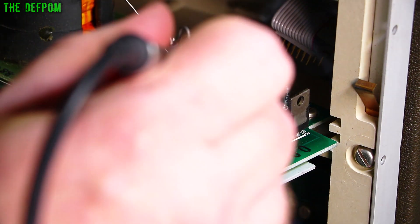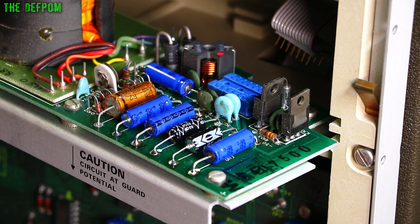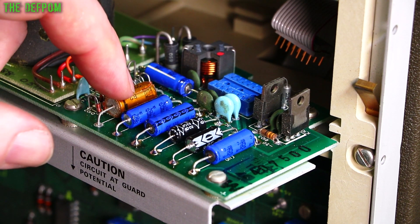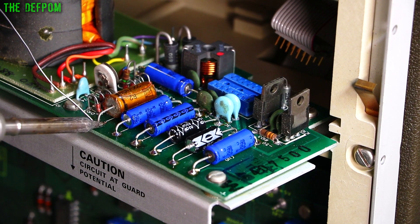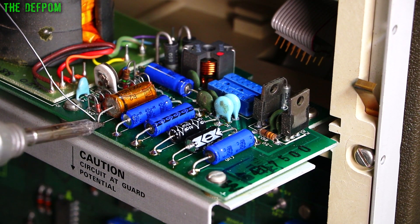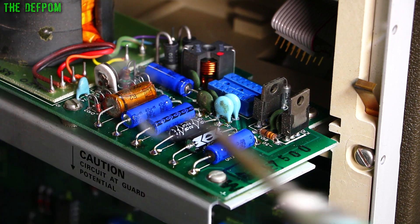So that's those along — do the other end, seems a bit harder to get to. I'm using silver solder for this; I always use decent solder on this kind of equipment. Probably doesn't matter too much with a power supply, but I still like to use it. Now let's get this one out, which I know needs replacing as well. I'll put some fresh solder on here just to get it to wick properly, get it all nice and flowing. Same on the other end.